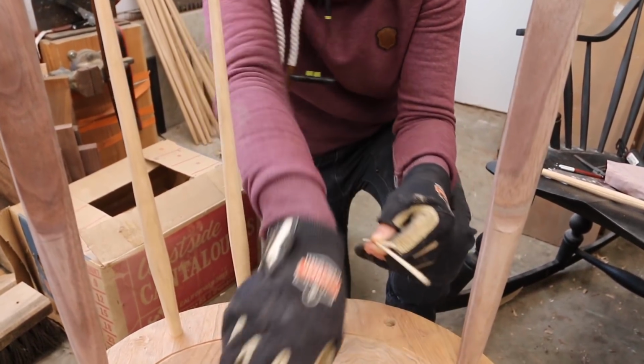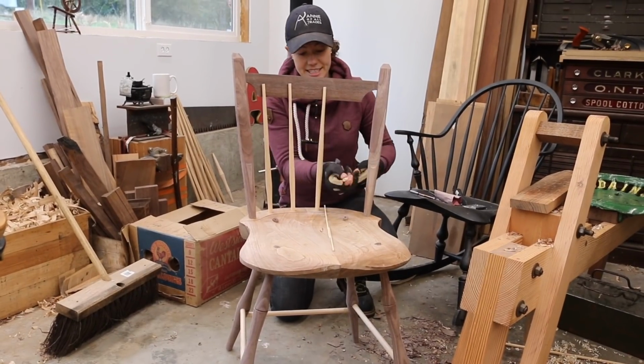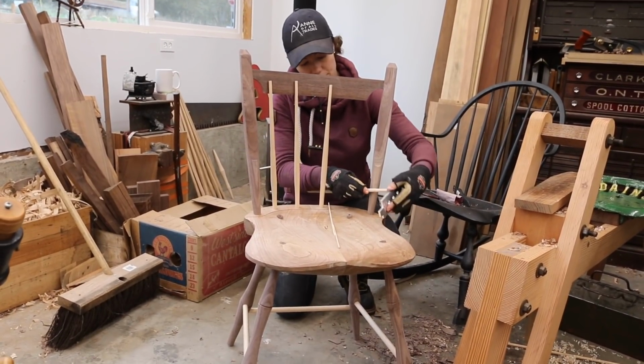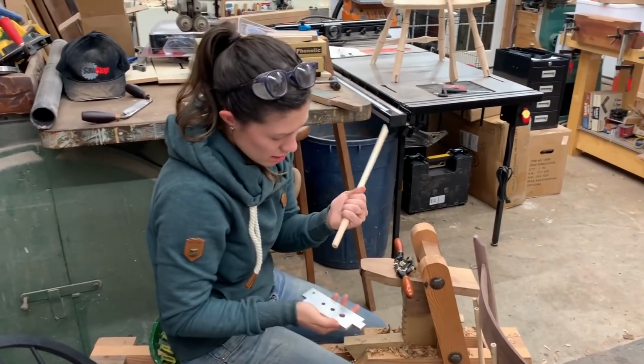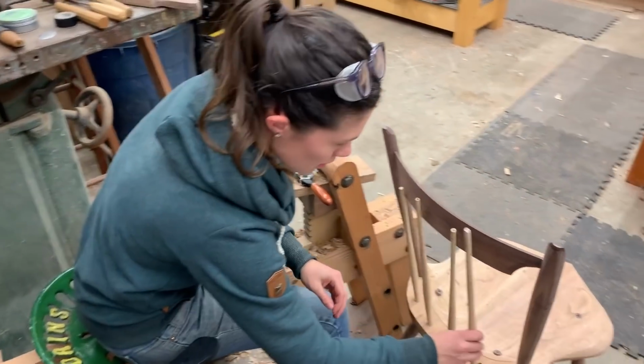And then I want to cut that down to that proper size and then make sure that this is shaped correctly. And to do that, I'm going to use a spindle gauge. And basically this is an aluminum thing that if it's oversized in any area on the spindle, it will actually rub off the aluminum on it, so you know where you need to remove material.